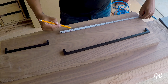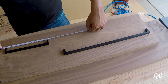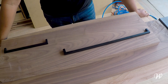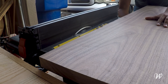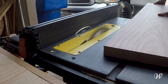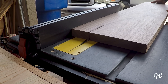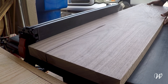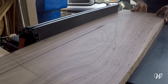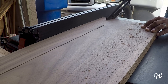We're going to play around with some hooks — I don't know how many we're going to add, but we're going to get a rough estimate on spacing and play around with it as we go. With a rough estimate of how I wanted this organizer to look, I went over to my table saw and cut one long strip at about three inches wide. This strip will act as both of my shelves — I'll cut this piece down into one that is 19 inches and the other that is about 10.